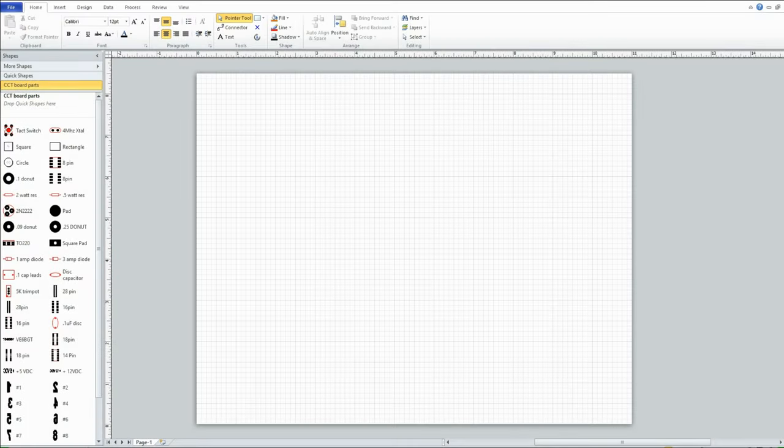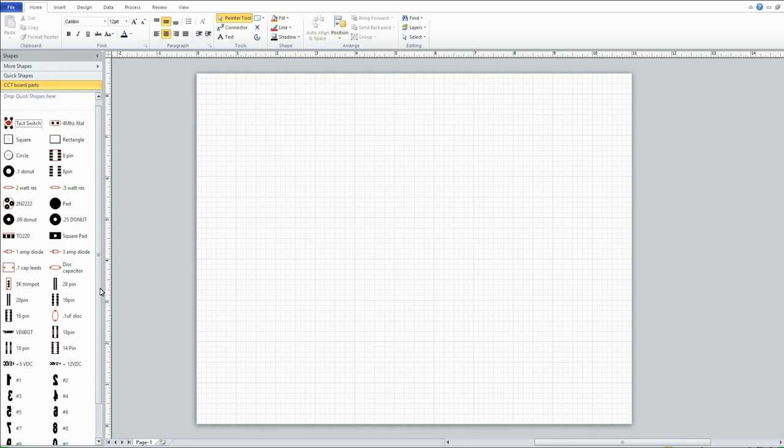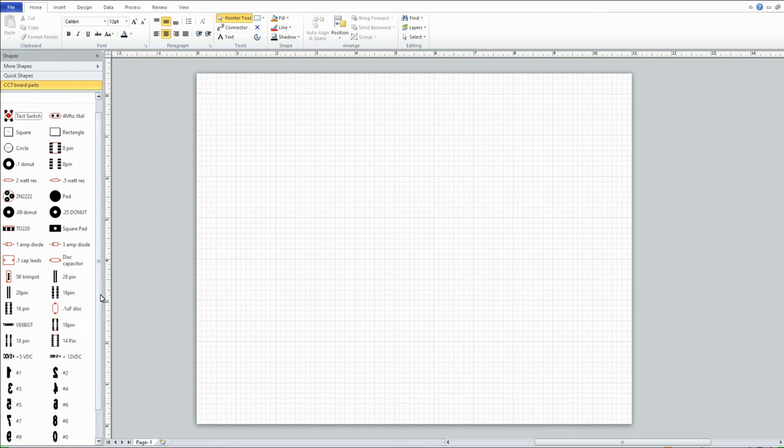So the circuit board. I have to build a layout for this thing for the clear transparency for the circuit board production. I'm not going to show the whole thing here, but this is how I do it. I've built my own. This is Visio, and I've built my own icons here of different parts and pieces. These are the through-hole parts. I've got a separate one for doing surface mount also. Anyway, start with a PIC, which is a 28-pin. I grab this, pull it in here, put it in the center somewhere.